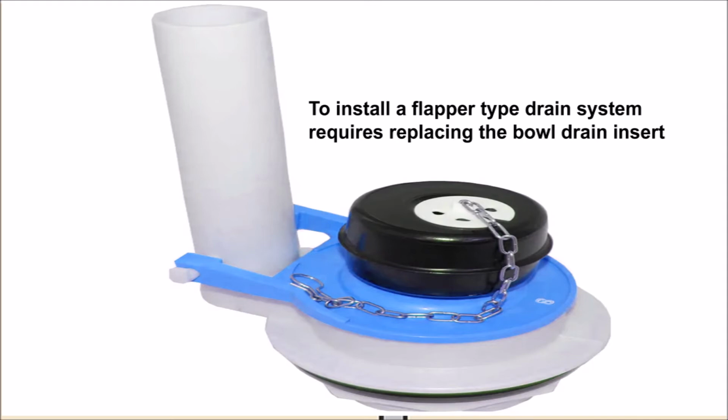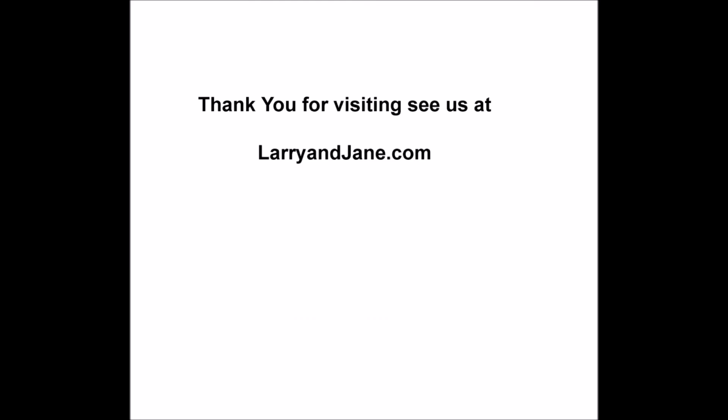And the thing just pushes in. It's a tight seal, but you can see it has that pipe running out, and that's where the water keeps flowing in there when it drains. The excess water will drain through that vertical pipe. But this is the kind of drain you'll need, and this one actually comes with its own flapper, but you get how it's done. But you'll see how those ears connect to that vertical shaft if you ever have to replace the flapper portion.